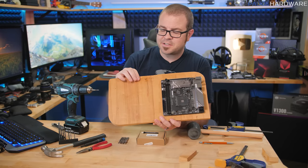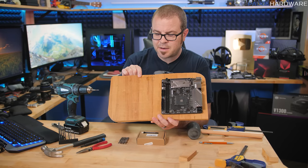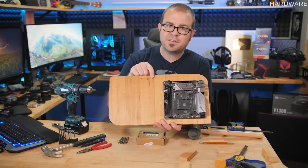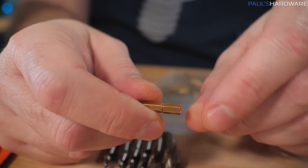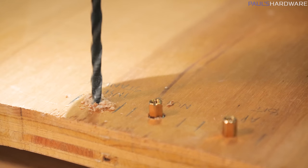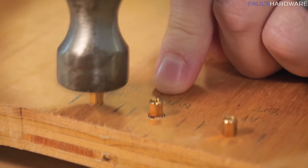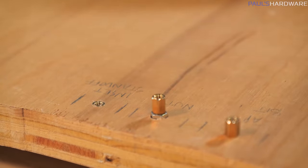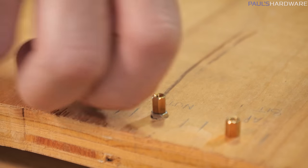Or if you had a lot of weight attached to it, then you might be a little bit less confident in that method. What I think I'm going to do is the inset standoff method — I have the standoffs that just have holes on both ends, drill a smaller hole, and set that directly into the wood by hammering it into place. The hex shape of the standoffs themselves helps to keep them wedged into the hole.